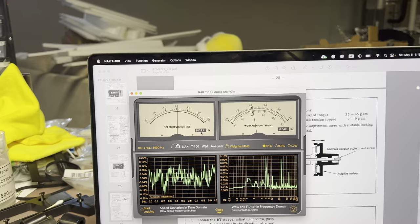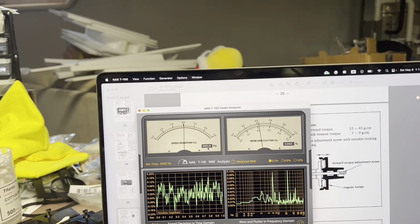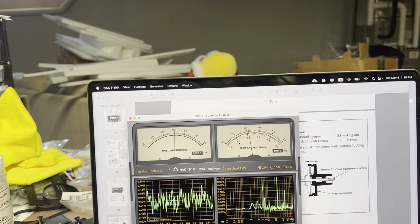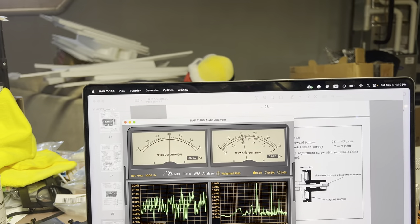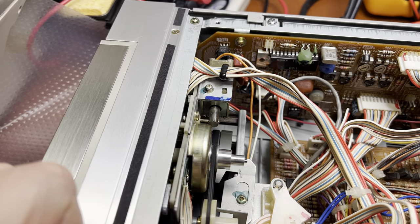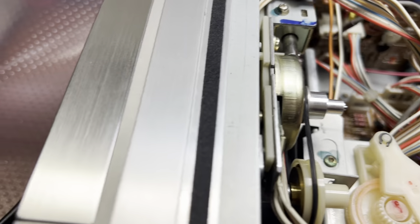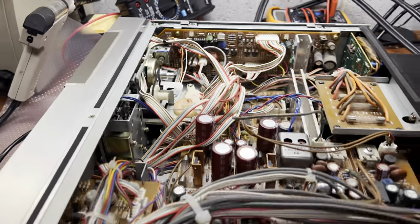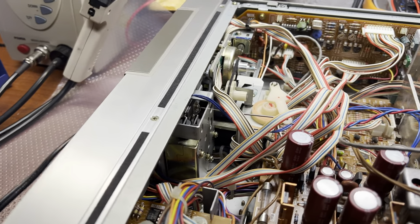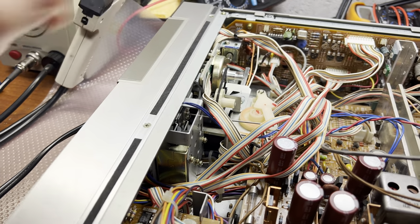As a result the speed normalized - it gets like 3001 hertz. You see these ups and downs - technically this is a magnetic thing. When it runs smoothly it's fine, sometimes it screams a little bit. That's probably a magnetic friction mechanism - it needs to be disassembled and the bearings lubricated.